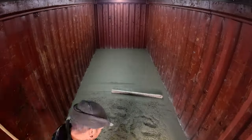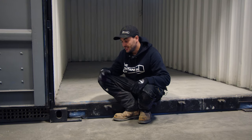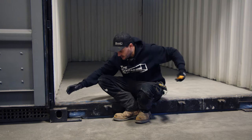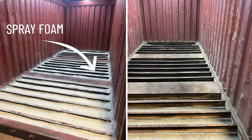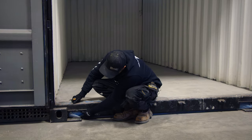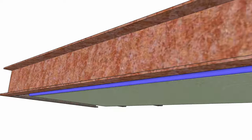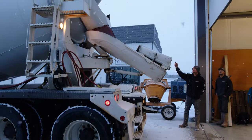To do that, there are areas where the concrete would just come flying out everywhere and be a real big mess. So what we did in this instance is spray foam first. You can see that we've taken poly and laid that all in ahead of time. You can also see there's a pool noodle in there — we utilize pool noodles or foam all the way around the perimeter to really ensure that the spray foam didn't fly out in random areas prior to the concrete crew coming.